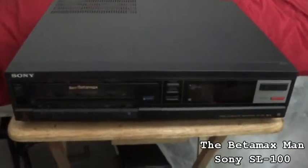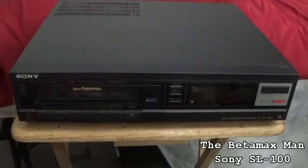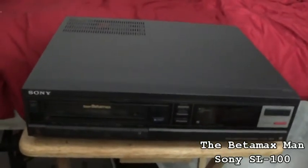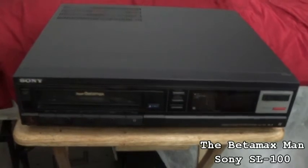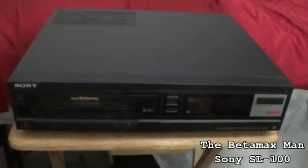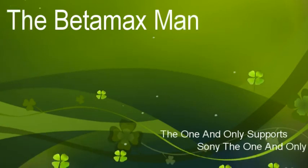I'm sorry this video was so long — I didn't want it to be this long, but I had no choice because this thing had quite a few problems. It was three or four different types of issues: the power supply being messed up, the cassette basket being messed up, then thinking the Hall Effect device had failed — which it hadn't. The failure was actually caused by bad, leaky capacitors in the system control circuitry. Anyway, see you guys later. Bye-bye.